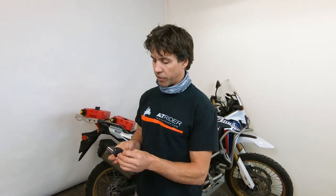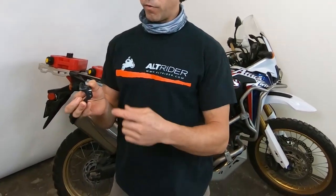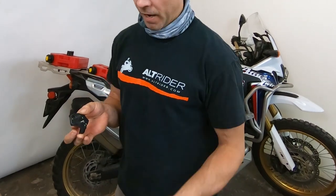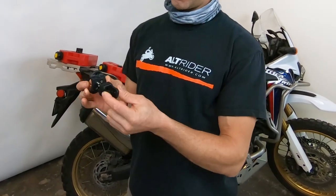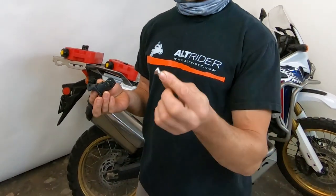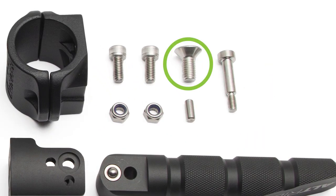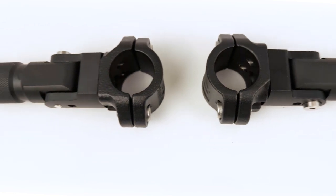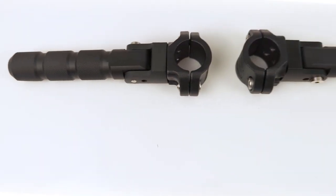In order to ensure good durability across the different adjustments, you have an M5 stainless steel dowel that goes into the stainless steel clamp. Once you've set and selected your position, it is backed up with a stout M8 fastener. This ensures you get full adjustability with long-term reliable durability so that the clamp holds up over life and is fully adjustable.